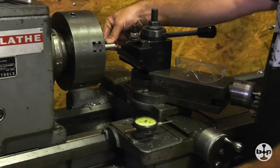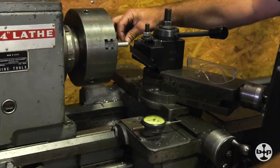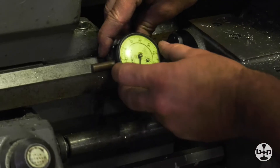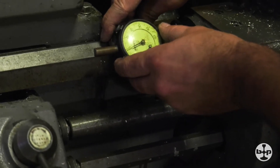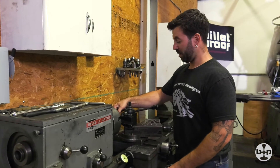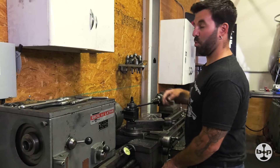I have a piece of half-inch diameter aluminum round bar here and I want to make half-inch long bungs. I take the magnet, I mount it to the way, I zero out the indicator. I touch my tool off — in this particular case it's a parting tool — against my material, and I move over the width of that tool.